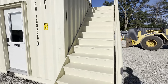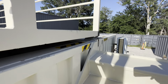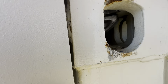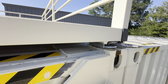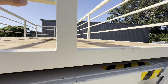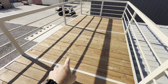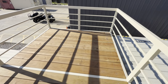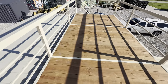Let's walk up the steps and take a look. You can see here we've got the clamps — all you do is spin that clamp like that and this entire deck comes off. It fits perfectly. It's all two-by-three, and then we did a couple of braces across the middle. What this does is support all the deck boards and transfers the weight to the sides where we've got support. So when you walk on it, it's not bouncy at all and it's not putting any weight on the center of the roof of the container.